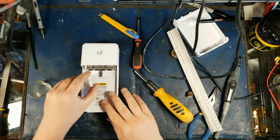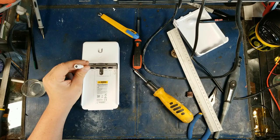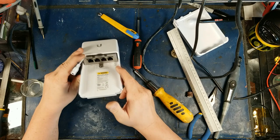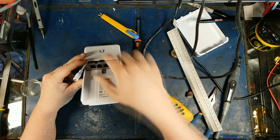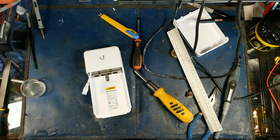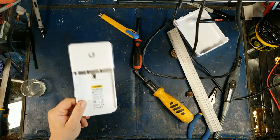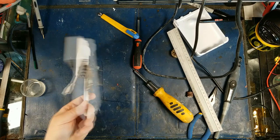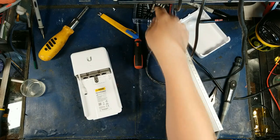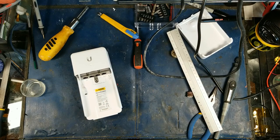This is going to go to my 12-volt to 24-volt DC-to-DC boost converter, which will then allow me to power my onboard radios from these ports, and then connect this one into my little router. I do have a PowerBox Pro in my truck as well, but this is when I don't need to use the router — it's just a simple power switch. So there we go: I just modded that switch to work in my truck by adding a DIN rail, a full bridge rectifier, and a tail to connect everything to.